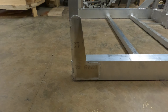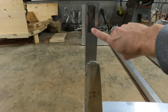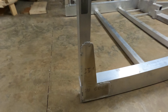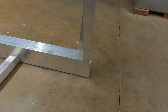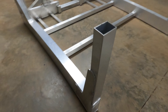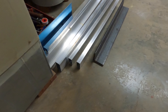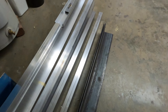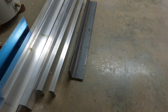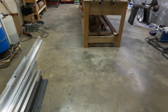A couple of quick updates. I got the front pieces welded on to the frame — the vertical tubes, the splice plates, and the front caps are all welded on. There will be another splice plate on the inside once I get the front attached to the car and can see exactly where they need to go, but they are done for both sides. Also, UPS came through today and delivered all the metal I was waiting on and nothing was delayed. I have some small pieces here on top that I need to start cutting down to size — these will be cut to smaller pieces for the suspension parts to attach to. Since the tubing is here, let's get back to working on the front of the car.